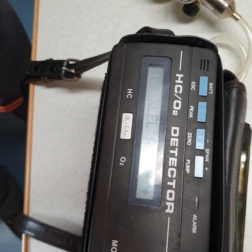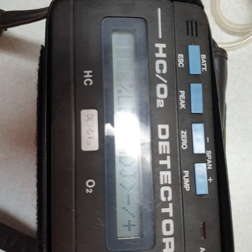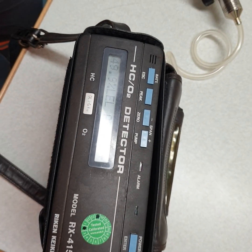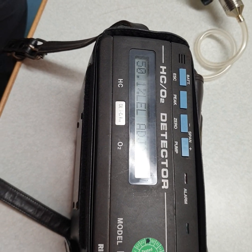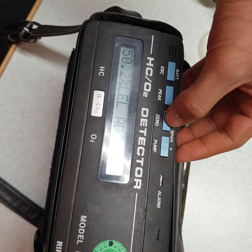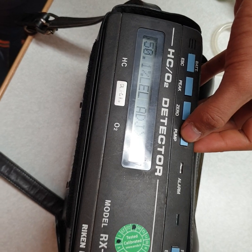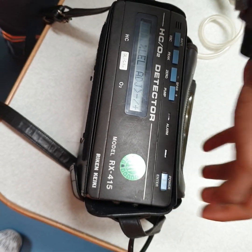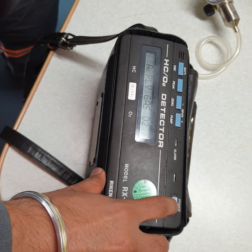We have the bottle set at 50% ideal, so it is very close — now it's 49.7 which will slowly go towards 50. We will make it stable first, and once it gets stable, by using the plus and minus signs you can adjust. Now it is getting less — whichever value you desire, you just press enter and the span gas is set.